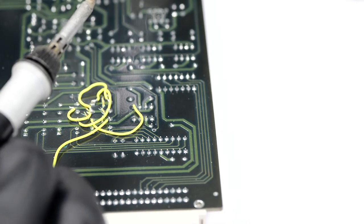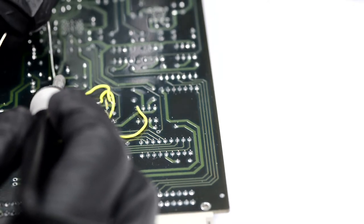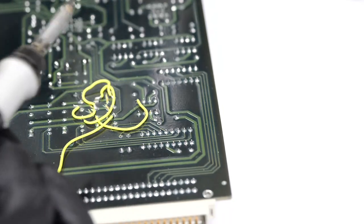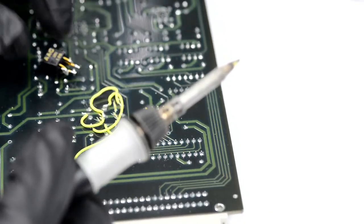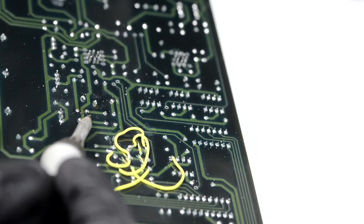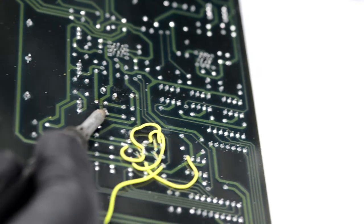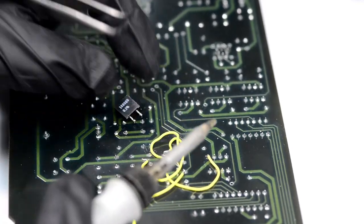And I think I'll need more of the solder to help it with the thermal conduction. So I'll replace this guy, that guy, and this guy. And that's it. That's my botched 100 ohm resistor. Let's get the 1 kilo ohm out. Actually, I need a better handle. That's the 1 kilo, also out.